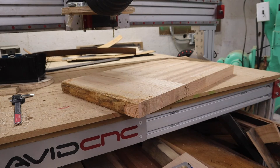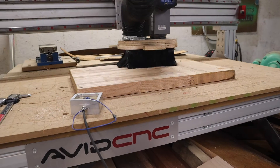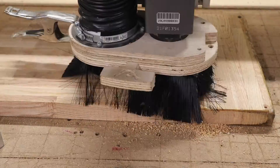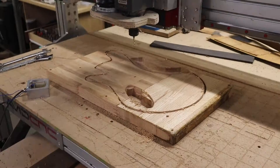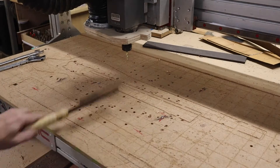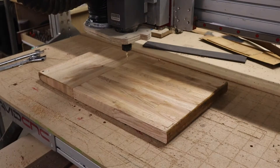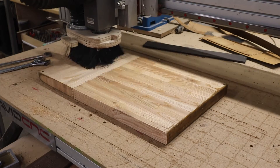I find the center and line it all up. The file includes configurations for two pickups or one pickup, and also two different pickup styles — one is a store-bought EMG active electronics pickup, which I put in the one I make by hand, and the other is to use my pickup. It's going to cost about the same to get the active system as it would to get all the parts for the passive system. All I used to do this whole body was a quarter-inch ball nose to do the radius cuts and a quarter-inch end mill to cut all the pockets and straight cuts. I did that molding toolpath on the back to create the belly cut, cut out my cavity, then flipped it over with my little trick to drill guides into the wasteboard — a really useful way to make sure you line up your work.